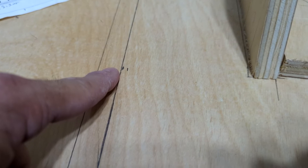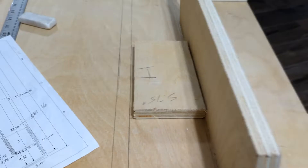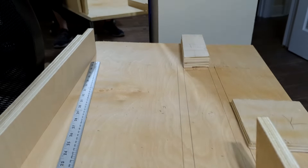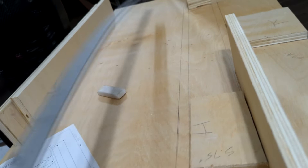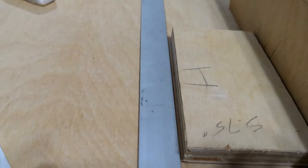If you lay an actual board in there you will see there is a gap. A three quarter inch board isn't quite three quarters of an inch — this is what Home Depot sells — so it's going to throw everything off. This mark here is not going to be where it should be. If you take a measurement off of the actual edge of the wood you're going to find this line is going to be a little off. So for example, the I board is going to determine the angle of this next board as it hits the G board up there.